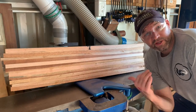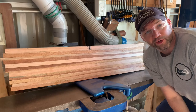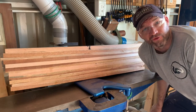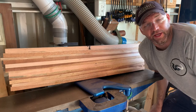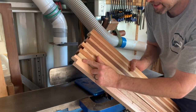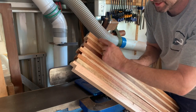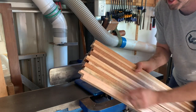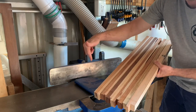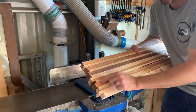First time using the jointer for slabs for me, and because I got these ones so flat — spending more time working on them before I glued them up — this thing really did a great job. Two passes and it's ready to go into the thicknesser. Also, don't spend a lot of time getting all your slats the same length. The ends can take a hit for the team if you do get any snipe, which I am on this machine because I'm still getting used to it, and same on the thicknesser — it's going to get cut off so it'll all be good.